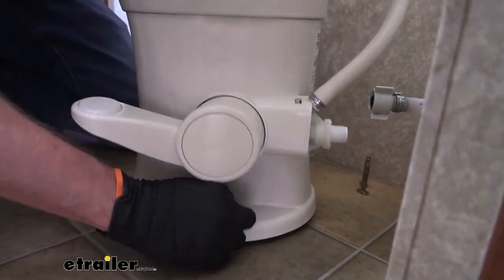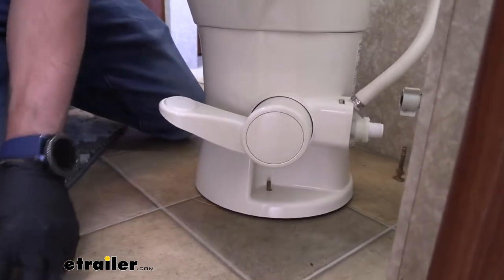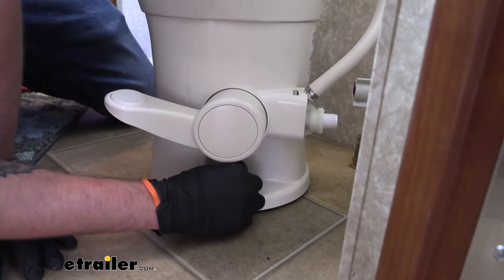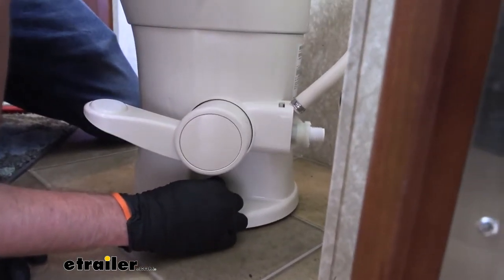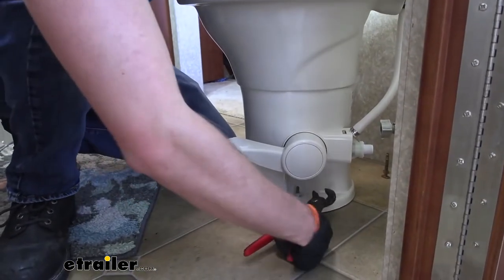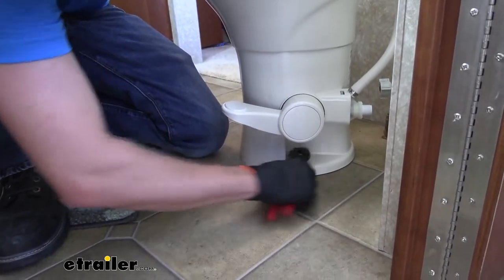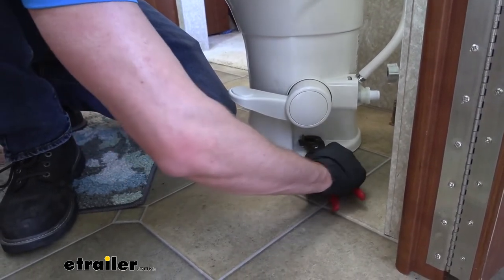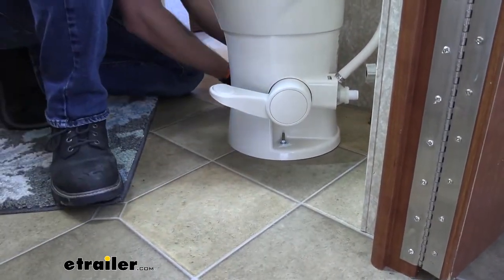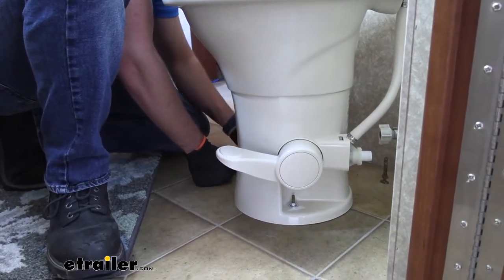It's a little bit hard to do. With our toilet in place, we're going to go ahead and take our supplied washer — that's going to help spread out the weight when we start tightening it down with our nut. Go ahead and just hand-thread these on, then do the same thing to the other side. Now that we have our toilet hand-tightened down, we're going to come back with our channel locks. I'm going to go back and forth between the two bolts because I don't want our toilet to end up uneven, because then we're not going to get a good seal with our gasket. When tightening these, you want to make sure it's nice and tight, but not so tight that you end up breaking either the flange bolt or the flange itself — because then you'll have to replace both of them.